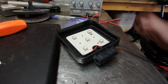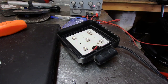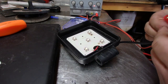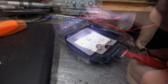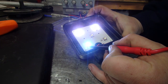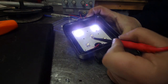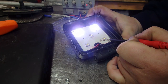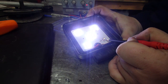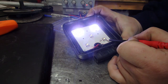So what I'm going to do is hook up my ground. Now I've got my ground hooked up full time. If I bridge a port here, see that one comes on. Those two come on. Going to bridge on this side. So that's the problem — why it's shorted out is this LED light right here is shorted out.